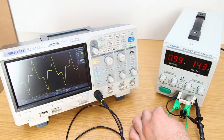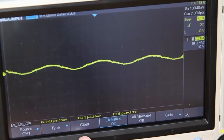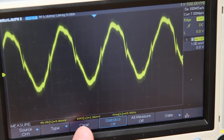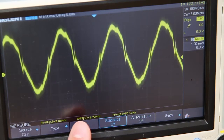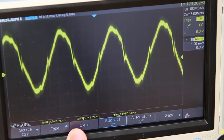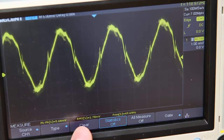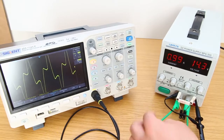Here is another clue. We have our ripple back, and now watch what happens if I disconnect the negative output terminal from ground. Whoa — most of our signal is gone. We are now below 2 mV RMS, although this looks a lot noisier. We reduced the noise more than 10-fold. I think this is the other part of the ripple — the actual ripple from the voltage regulation. This is what went missing when we disabled the output. And now we have the probable source of most of the ripple: the ground terminal. If I plug that back in, our ripple is back.